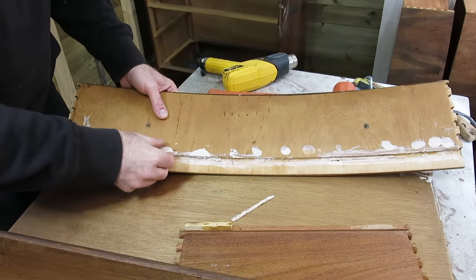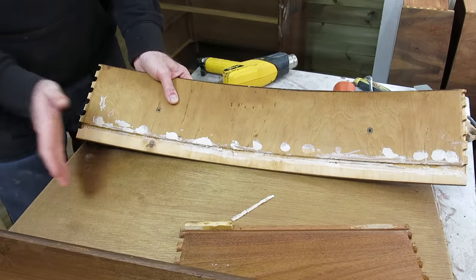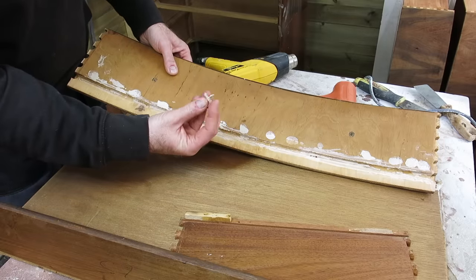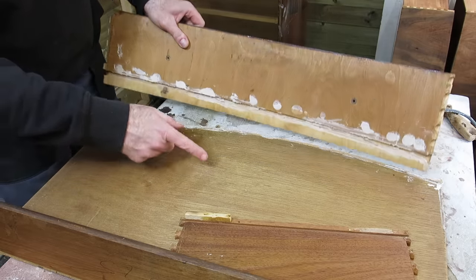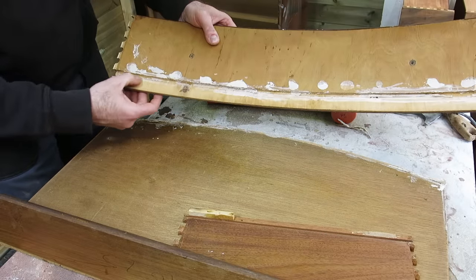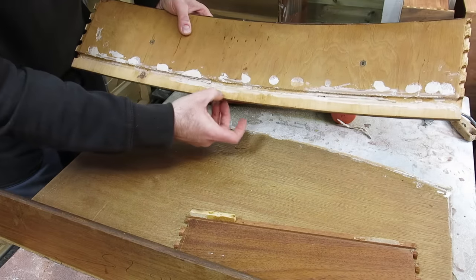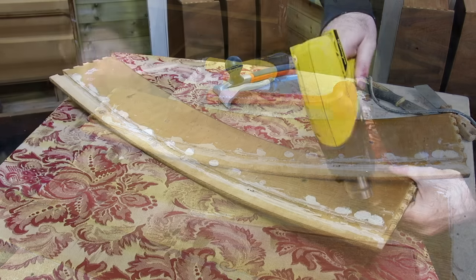Sorry, I forgot to press record again. What I've done is I've taken these sides off. That one was already missing. I've taken this side off, heated all this, and managed to separate it from the base. And this looks like silicone sealant, like bathroom sealant. I think this part should sit in a rebate there, and on first glance that rebate is very, very shallow. So either that or something's come off the bottom there that should be on. So I'll have a look at that and clean it up first and then see what we need to do.